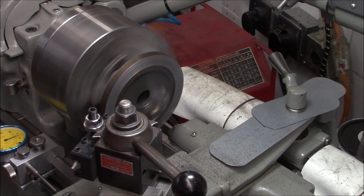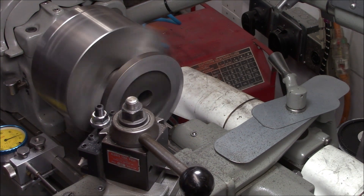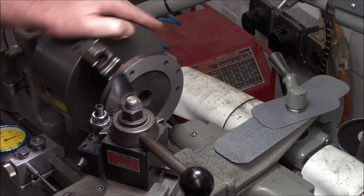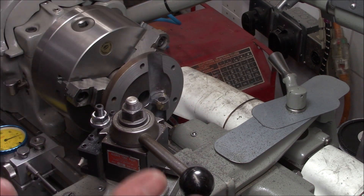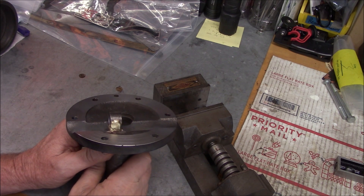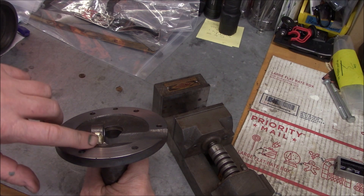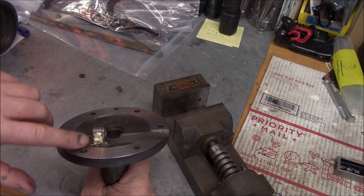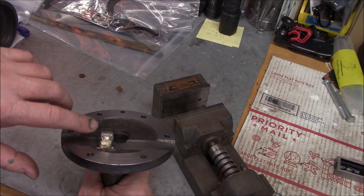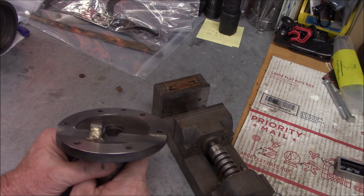Okay, we cleaned up all the way around — that's all we're doing. Let's take a look at our braze job here. I deliberately did not do any dressing. I left as much of the brass on here as I could. I wanted to keep a cap on here just to give it a little more bridging across that fracture for extra strength.